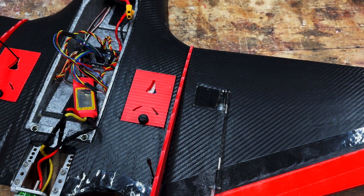This little 3D printed thing — which may need slight modifying — is basically a canopy latch to go here. I'm trying to make it as thin as possible. I could just add some filler to the front but I don't want to use tape because it'll rip up the laminate. Hinges are a nightmare because of how far the RunCam 4K sticks out. The solution is to glue it on — using Goop or E6000 which is a bit thinner and should allow it to be removed more easily.